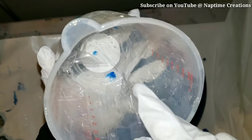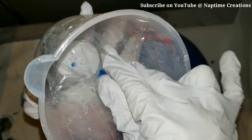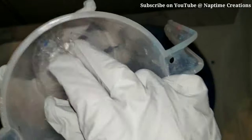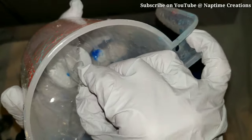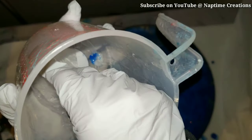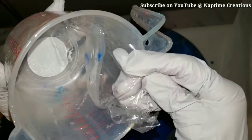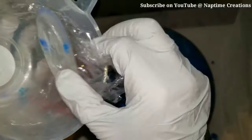I wanted to show you one way to clean your mixing cup. Let your resin set up in your cup, and about 24 hours later you can push around the rim and break some of that resin free, then pull it out in one piece. This will only work if your parts A and B are 100% mixed together. Otherwise, you can take a baby wipe and some alcohol and clean your cup out right after you're done pouring.